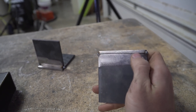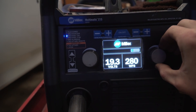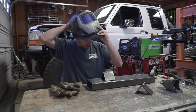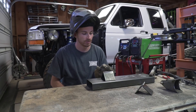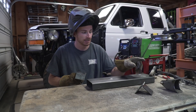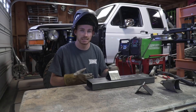I'll start with the butted-up joint and show what that ends up looking like. I'll set the welder a little bit hotter than normal - around 19.3 volts and wire feed speed to about 290. I'm working with 3/16 cold rolled on all this stuff, so all the material is exactly the same, but the settings will change for each type of joint since you don't want to run the same settings for a butted joint as you would for an outside corner joint.